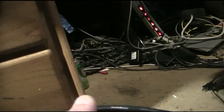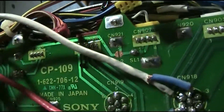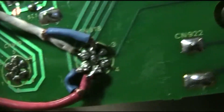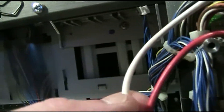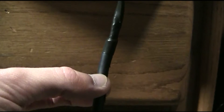It's high-performance S-Video cable that comes on a roll. It is the most delicate cable — the only thing that's good in it is the metal, and the braiding is good. You can see it's actually pretty well braided and has good shielding. But if you look here, you can see I hardly did anything to it and the wire on the inside just came right through. So that's going to be covered with hot glue. I had to put extra heat shrink on it there and there and there. I had to patch a tear in this outer jacket — this stuff is ridiculously thin and easy to tear. I've added black heat shrink tubing all the way down to where it starts. The outer jacket damages quite easily, but at least it's rather thick, so I'm not worried about it.